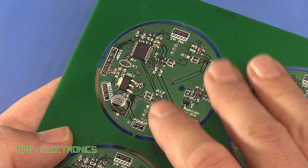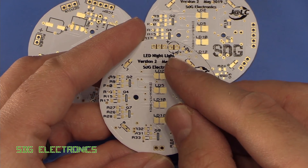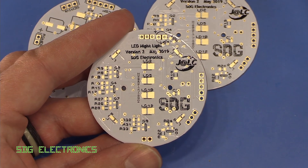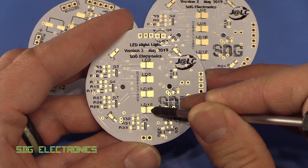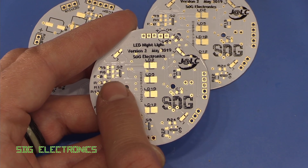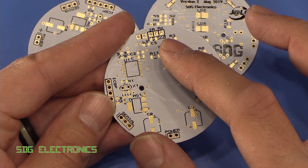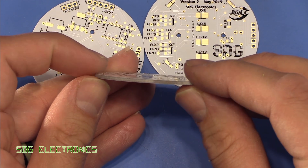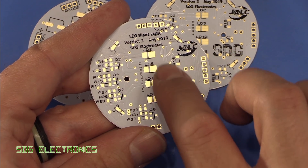Camden wants all the colours now, so I had some new PCBs made at JLCPCB. These have been sitting for a long time but it's time to get this project underway. This time we've got several channels of coloured LEDs — red, amber, green, and blue — plus four white LEDs, one in each corner. There are little drivers for each channel, and on the other side we've got the microcontroller, 3.3V regulator, and infrared remote control. The PCBs are 1.6mm with a white finish.